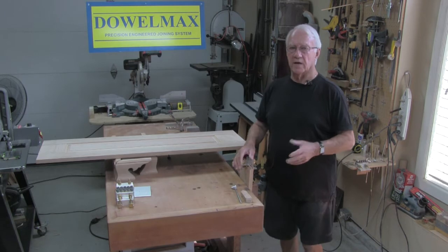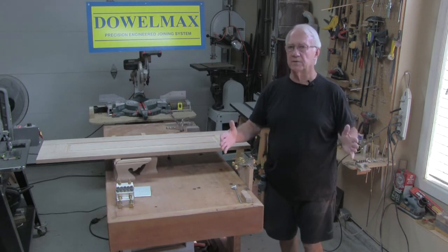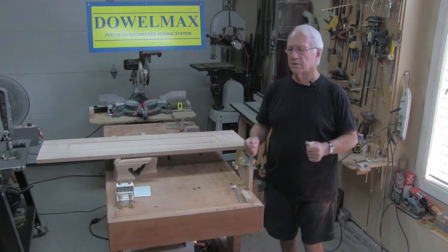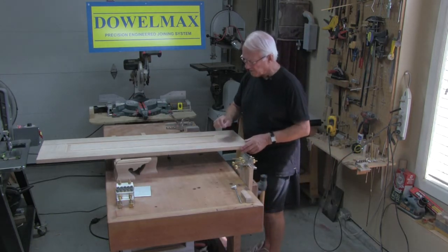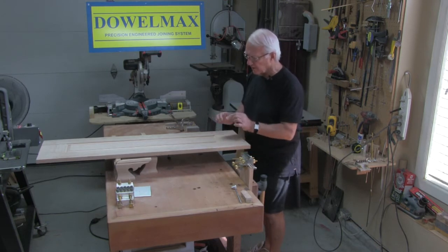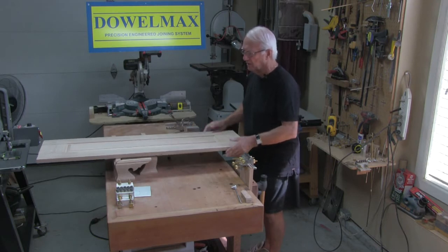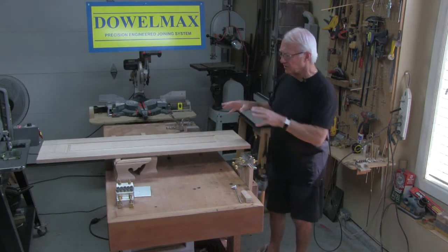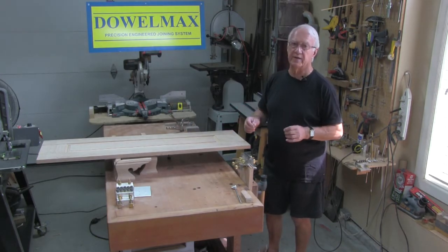As with any of my designs, I like to utilise raised panels at the ends of the finished piece. There is a problem here because the raised panel system has a stub tenon incorporated in the design and it's only 3/8 in width and it's extremely weak. So with the finished product, this is a structural area — the two ends are structural and you want to avoid racking.